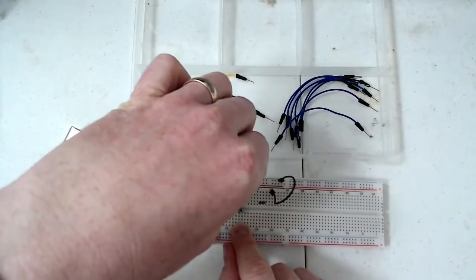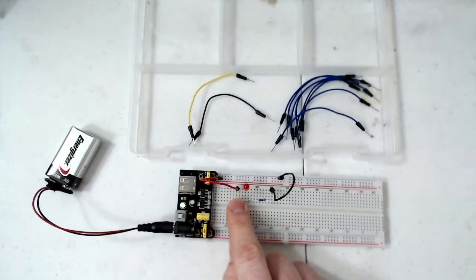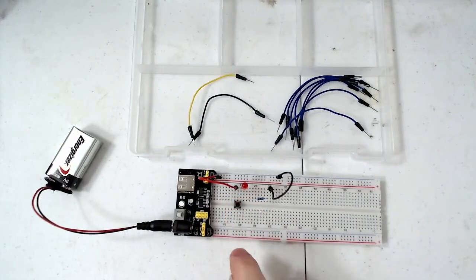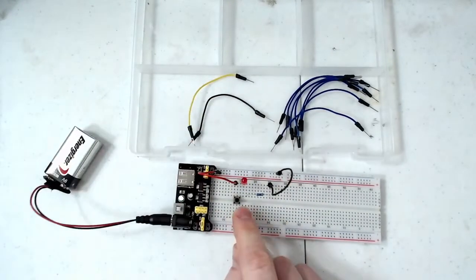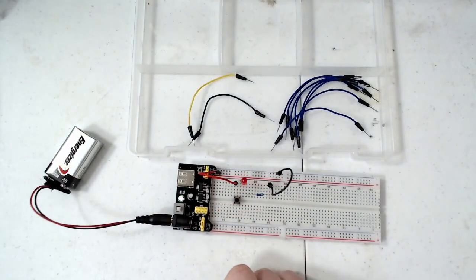When I press the button — there we go! I can light up the LED by holding down the button. The button simply connects the two legs on one side to the two legs on the other side, completing the circuit and conducting electricity through the LED. If your LED doesn't light up, you most likely have it in the wrong way around — flipping it the wrong way, pressing the button, and it doesn't work. Put it back the right way and there we have it — your first circuit. Give that a go and I'll see you at the next lesson.